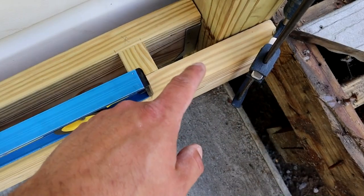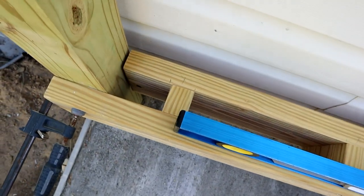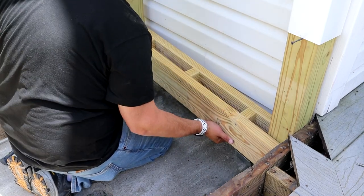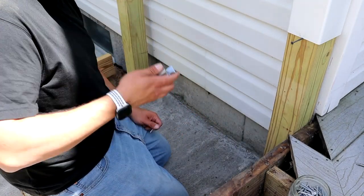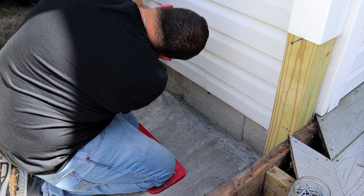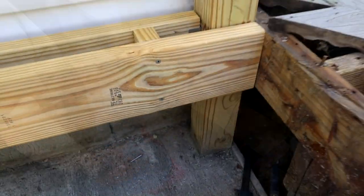I can't wrap a traditional joist hanger around the outside of the post, so I've got to come down this side. I slipped the hanger in and scribed underneath it and that gives me my height. Moving the whole assembly - nail that thing in, same thing on this side, put that in there, scribe it, pull out the beam, drive the nails. Inch and a half nails hold these hangers in place - these are made by Simpson and the nails are by Simpson also. Let's see if this is right - hopefully it is. Yeah, that's perfect.